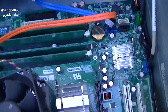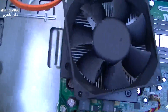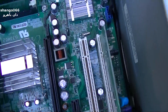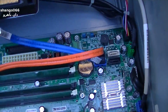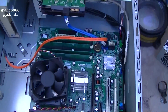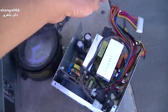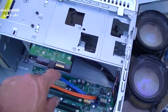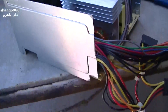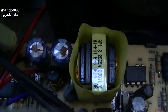So I blew it all out — it was completely packed with dust. You couldn't even see the fins there under the fan. I think it's a smoker computer. I blew it out and it still wouldn't power up. So I tried unplugging the main board and shorting the green wire to the black, and the drive would spin up. So I started debating whether it was the motherboard that went bad, or this power supply. So I pulled this apart and I just wanted to share these capacitors.